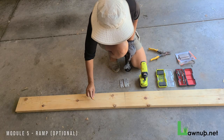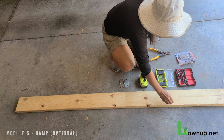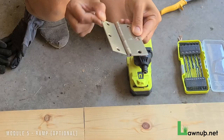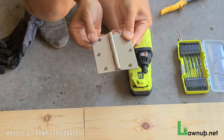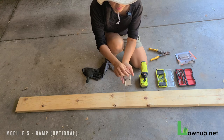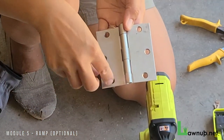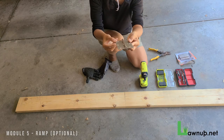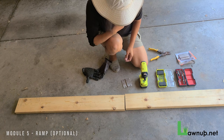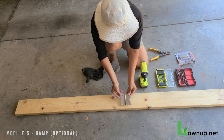For simple reference I'm writing the word 'down' on one piece so you know which side faces down. The hinge itself folds but doesn't go a full 360 degrees — it's about 270 degrees — so make sure the fold piece is on top, not the other way. The screw holes are slightly more flushed in, as if the screw head settles into them, so the whole piece goes on top. I'm placing it flush right on the cut piece and aligning it carefully.